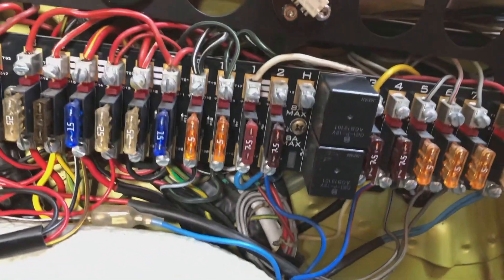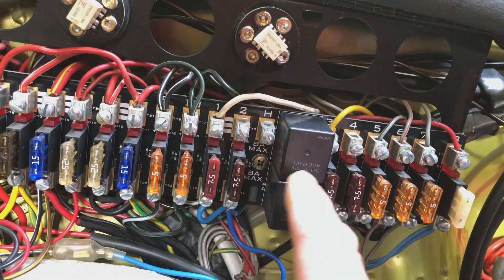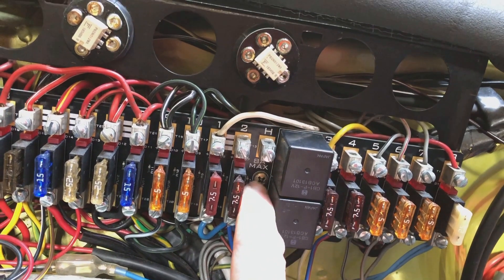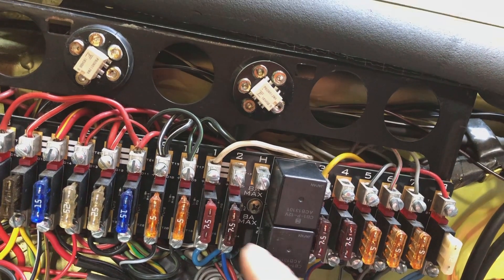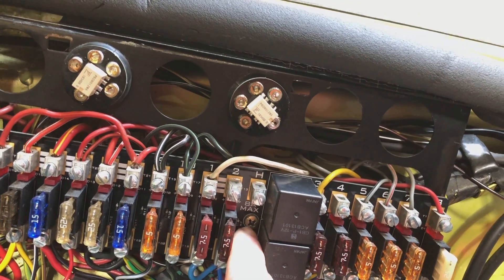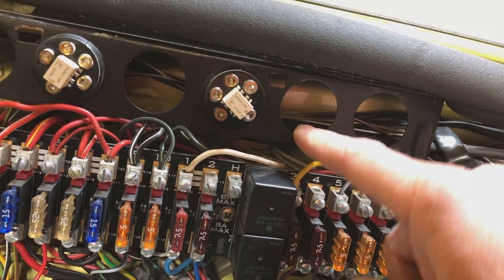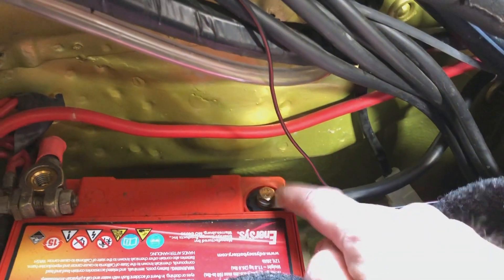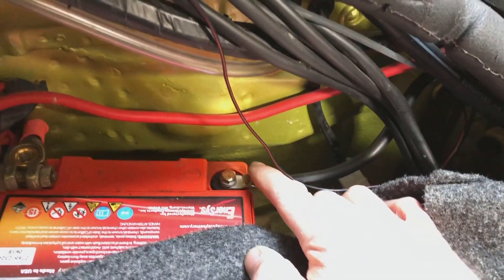When you install one of these panels, it's worth noting that the screw in here is the grounding point for these relays. We often get calls saying that the relays are not behaving or they keep switching on and off — it's all to do with this screw. You must make sure this screw is properly tightened against the metal panel, and secondly, that the metal panel is actually grounded to the battery negative. If you have a meter, you can check this by checking the resistance from this point down to the battery negative.